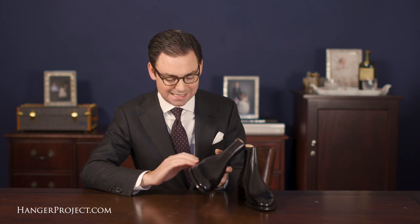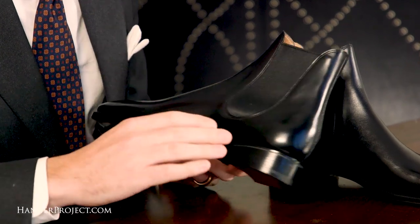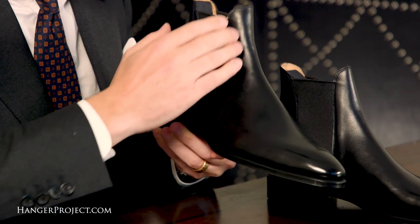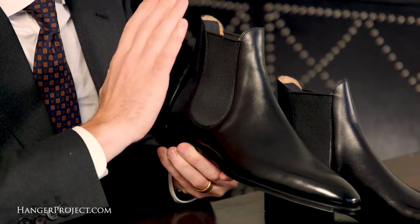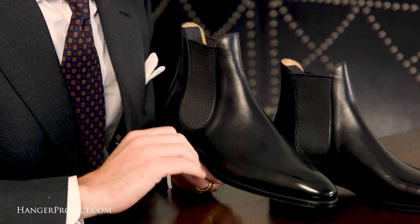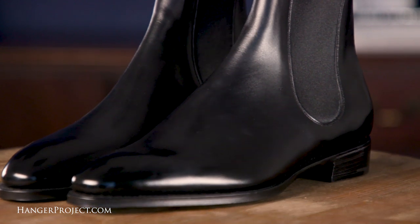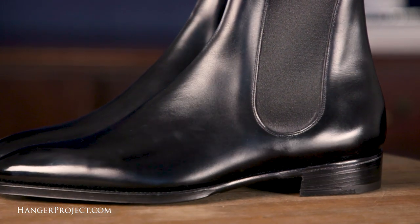What makes this boot special is the one-piece construction without any side seams, which is technically very expensive and difficult to achieve. Most ready-to-wear Chelsea boots have one to two side seams which make the upper easier to cut into shape. The one-piece construction requires that the uppers be soaked in water and then blocked for several days in order to create this beautiful shape from an otherwise flat piece of leather. The result is worth the extra effort. Tony Gazziano's shoe design brilliance is instantly recognizable — even though the design of the Chelsea boot is exceptionally simple, the sleek shape of the DG 70 last still makes it stand out as a beautiful and elegant shoe.